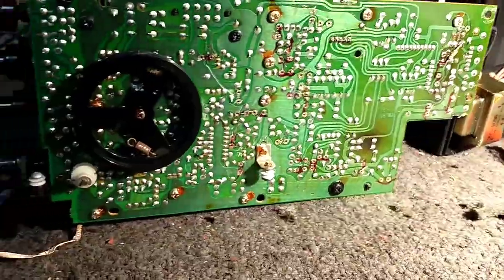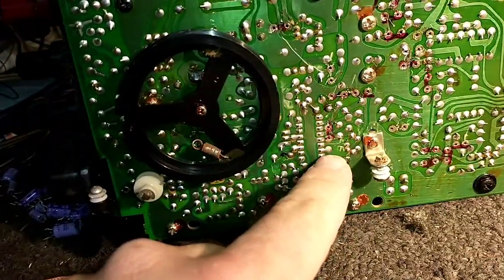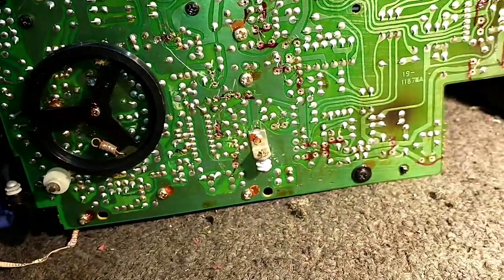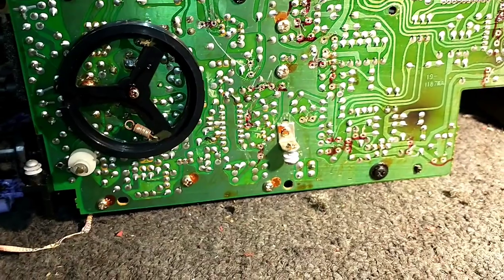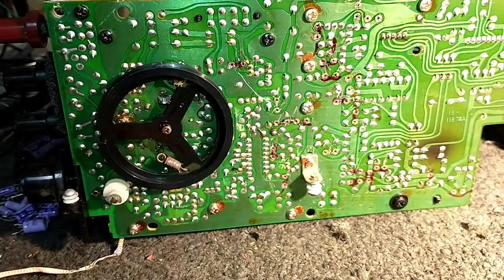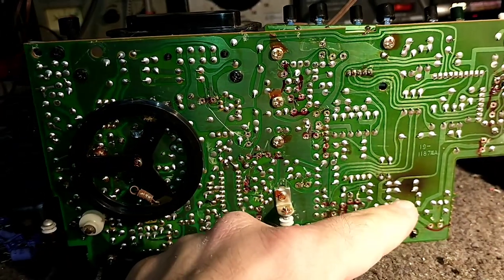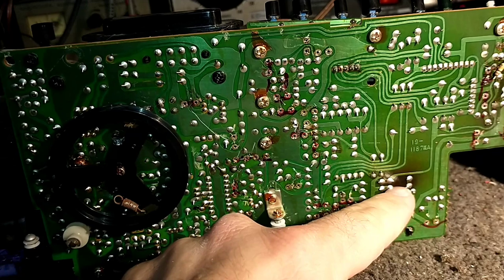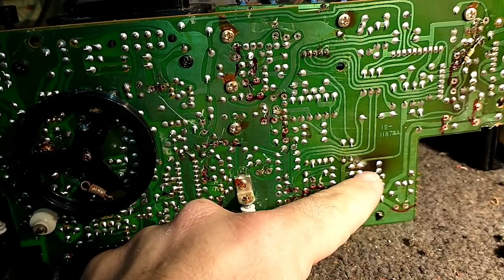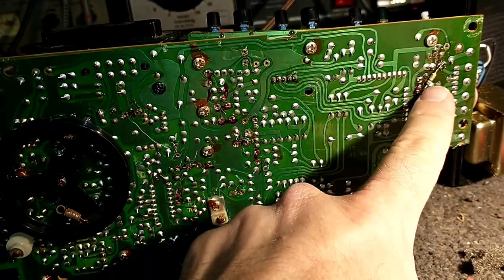The board is depopulated — I've got a nice pile of capacitors. Unfortunately, while taking two capacitors out, I slipped with my soldering iron, completely nailed the dial cord, and just murdered it. It went through it like a hot knife through butter. I got my replacement dial cord; it's a fairly easy thing with only a couple routing paths. But we'll first make sure the radio functions before we spend the time restringing the dial. We also have to figure out why the little zener dropping resistor here was getting so hot — looking for an adjacent capacitor nearby that could be shorted.